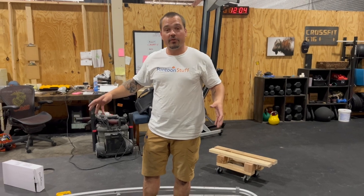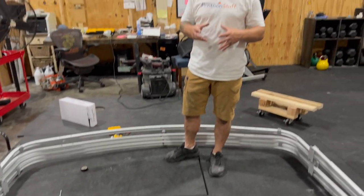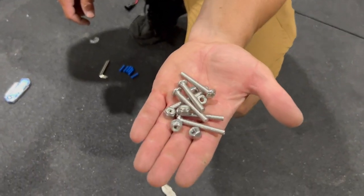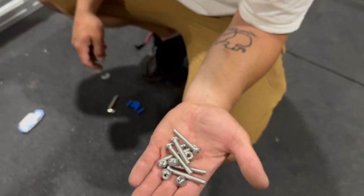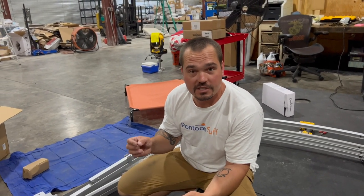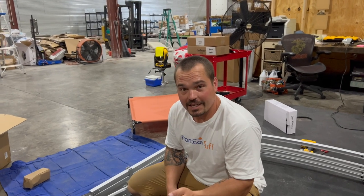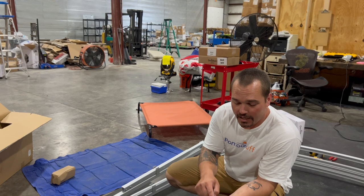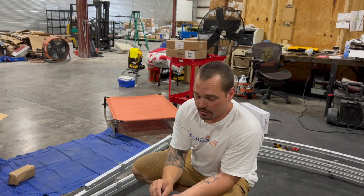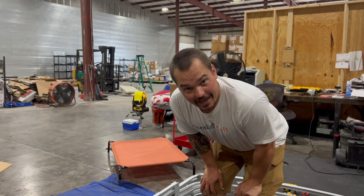We are all done with the frame for now. We're going to jump up on the boat and install our mounting brackets. You're going to need those stainless nuts and bolts and mounting brackets for this next part. You'll also need a quarter inch drill bit — I have a long extended bit. If you don't have one, you just need a pen or sharpie to mark spots on the railings. You'll also need a 7/16 wrench or socket for the nut, a Phillips number three screwdriver, and a tape measure to measure out your brackets.